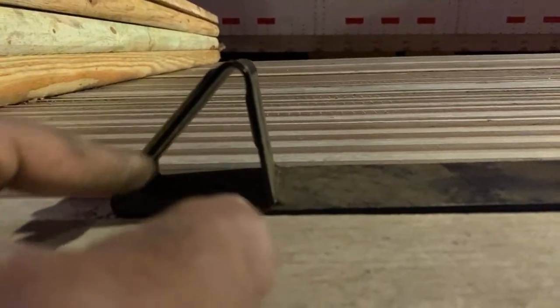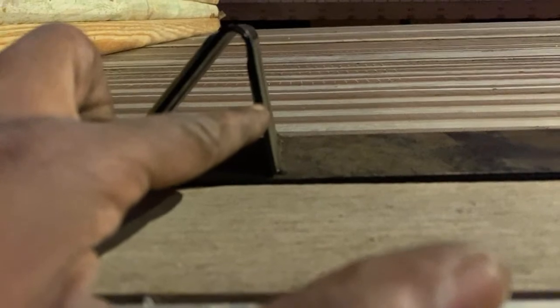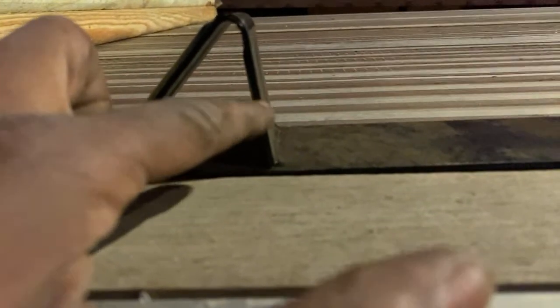This is the strong side, and this is the strong side because it's triangulated. So when you interface that with a 90, you press here and you press here. But you don't press here because that is the weakest part of the thing. So if you put that bevel and turn that curve like that, you press all the force right there. What does it do? It collapses this and pushes this into the product, and this will be the only thing holding that 9,000 pound core.